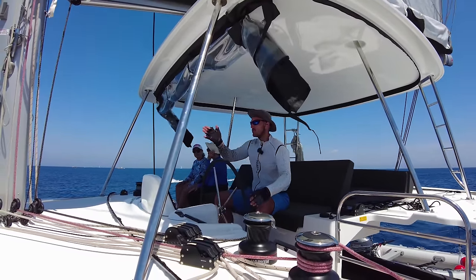So say you're crossing an ocean, the Bay of Biscay, and you want to be really sure it's going to be okay. So we want to make the apparent wind speed smaller. That's why I'm going to pick up speed. And also with the engines, the boat is very stable. If you're doing this without engines, the waves are kind of turning and you can mess it up at the wrong second and it just goes bang. So having the engines on actually makes the boat very stable.